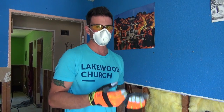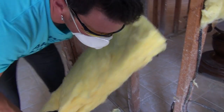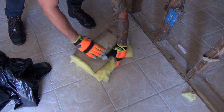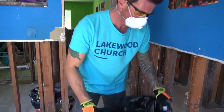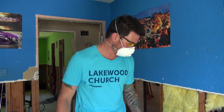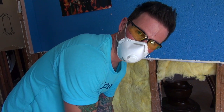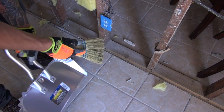Next, we're going to remove the insulation. The insulation is going to be very wet and soggy, so make sure you have nitrile or latex gloves underneath your heavy-duty gloves. Just pull the insulation down from the wall cavity, roll it up, and get it into a contractor bag. After removing the insulation, clean out the bays — sweep out everything you can. If you have a wet-and-dry vac, that's a great idea and makes very quick work of it.